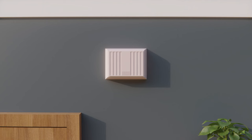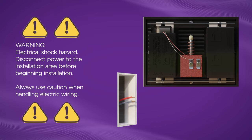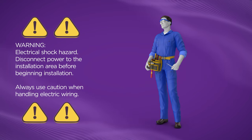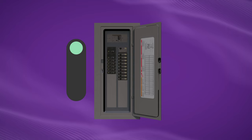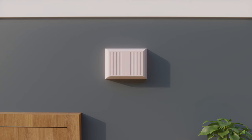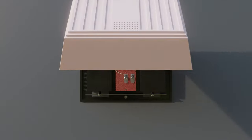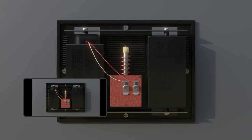We'll start by bypassing your home's existing chime so that when guests ring the doorbell, the sound comes from your Roku chime. We'll have to work with some electrical wiring. If at any point you don't feel comfortable working with the electrical wires or feel overwhelmed, stop and call your local electrician for help. Make sure the power to your doorbell chime is off by flipping your breaker switch. Locate your existing chime box — that's what makes noise when your guests press your doorbell.